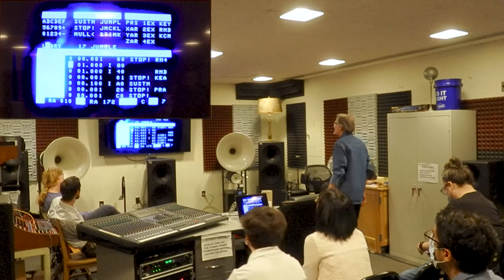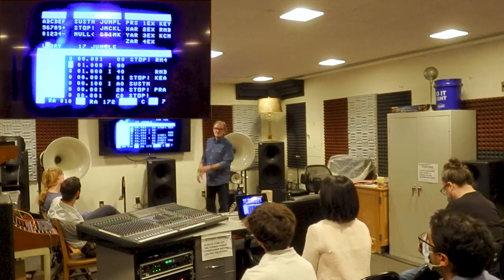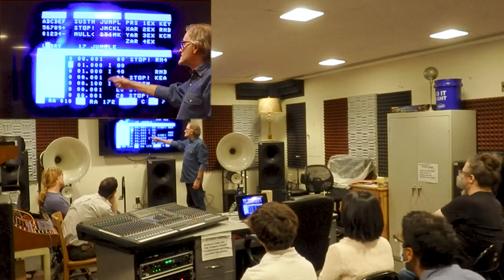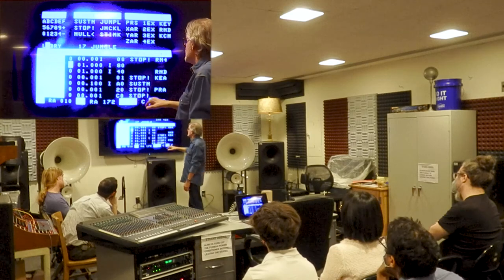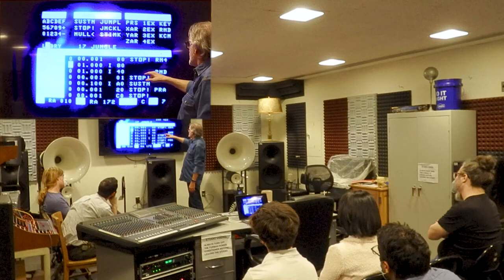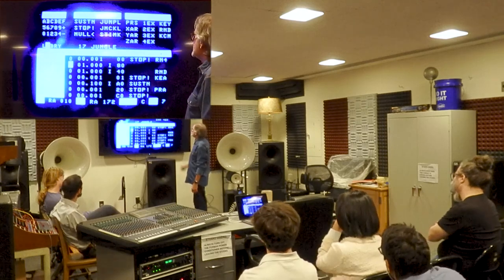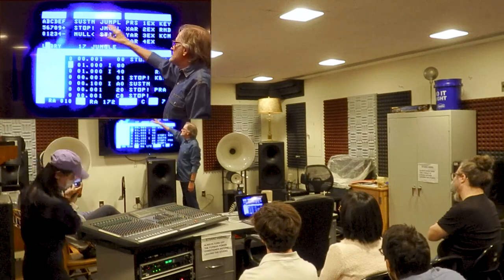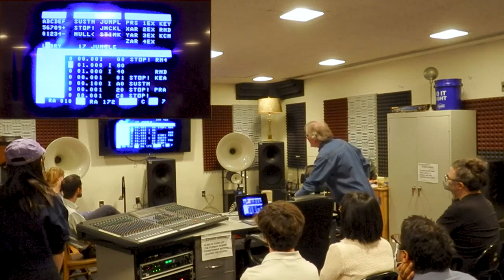And here's a page of programming. I'm sorry, it's just a photograph of the screen, and I don't have the instrument anymore. But these are lines of the MARF. So there would be time parameters, delays between going from one breakpoint to another, something having to do with whether it's a step or an interpolated, and then the voltage level, and then what to do with it. So stop or sustain, where is it going to go? And these are actions that would have to take place once it reached that point. So it looked like that. And then these are things you can make contingent on a stimulus value, a jump or a loop or something that you're programming. But that's what the screen looked like. Very high resolution display. That's a joke.